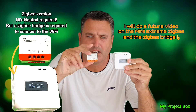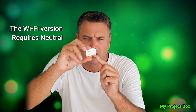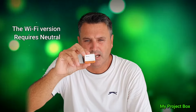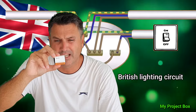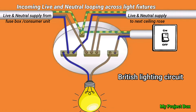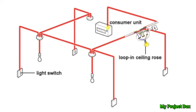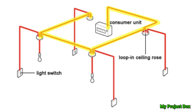So the WiFi version connects here, and the ZigBee version connects via ZigBee. I want to show you how you can still use the Sonoff Mini R4, which requires a neutral connection, in the UK. It's still possible to connect this to a lighting circuit even if there is no neutral connection behind the light switch, because in the UK it's very common to use a three-plate loop-in system where the live and neutral loop across at all the light fixtures.